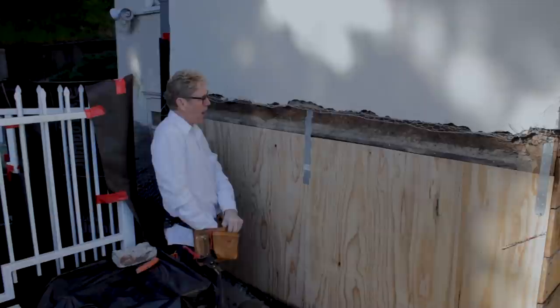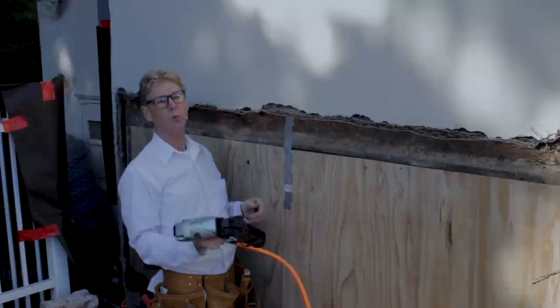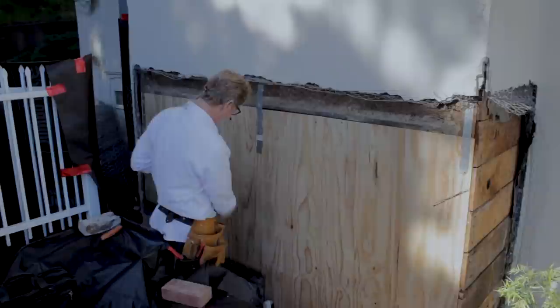When we get to areas where steel straps are — Simpson ties — once I've got the paper on I take a chalk and mark them. Why? Because when I use this staple gun, if I don't know the strap is there, the staple will bounce off and hit me in the face. I almost lost an eye once. I'm wearing glasses right now not just for stapling but because it's windy and all this stucco goes in your eyeballs.